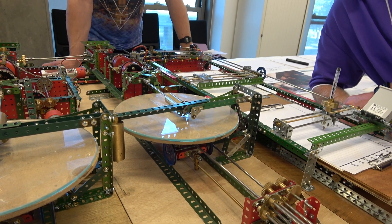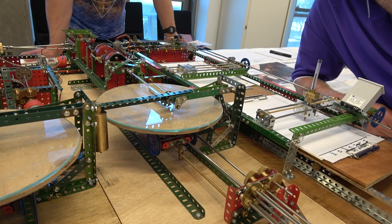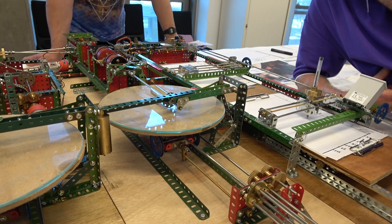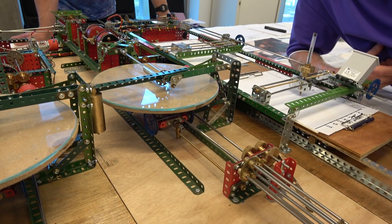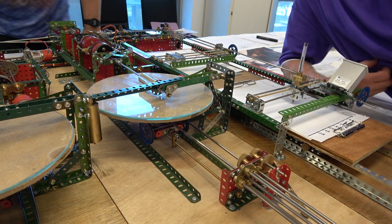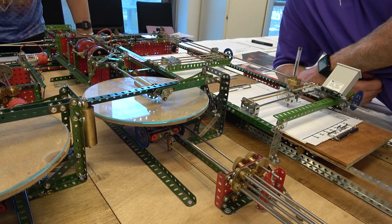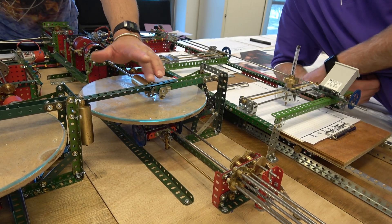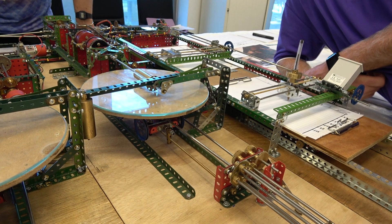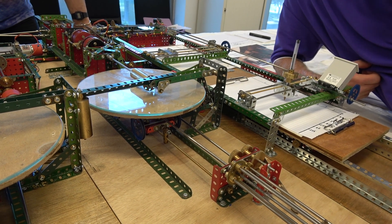Then I used the original plate glass, and I found that steel wheels didn't grip as well as brass wheels. Why is that? Maybe the coefficient of friction between glass and steel is different from that between glass and brass. Could it have anything to do with the fact that steel is harder than brass? It could well be. I've slightly serrated the edges of the brass to try and enhance any grip that we can actually get.